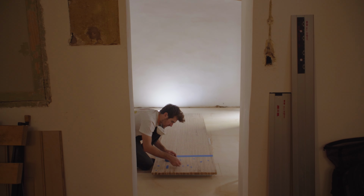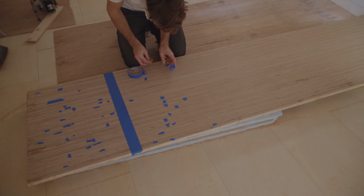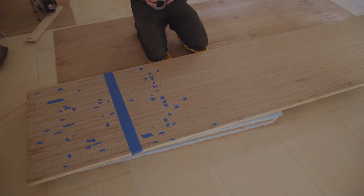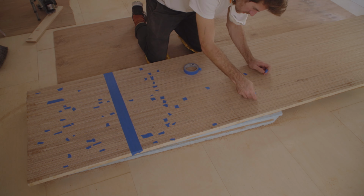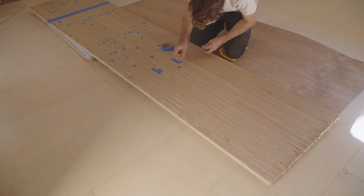Here I'm marking out and blocking all of the potential troubled areas where water could enter through gaps in the material from manufacturing. After flipping it over, I filled the gaps with flash cure epoxy and covered the remaining gaps with a silicone-based wood filler. Protection against water is an important factor in this build.